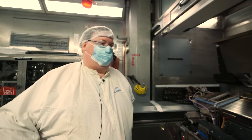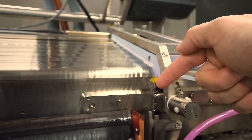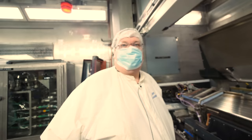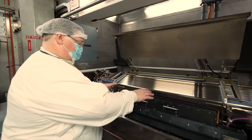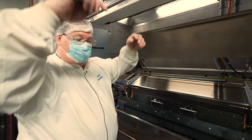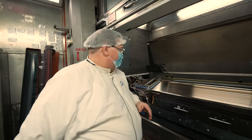We keep laminar flow — that's the secret. What I'm looking at right here is a stream of liquid that looks like one uniform waterfall, but it's actually a series of waterfalls in parallel. Exactly. We do a curtain hopper — what will happen is the roll will be ready underneath. There's a pan in the other room catching everything. It will pop out of position very quickly and then drop about 12 to 14 inches as a curtain. Now, if you pour any liquid out of a jar, it necks down — we can't have that. It's got to stay absolutely laminar all the way down the sides. We have some guide wires that help — those are one of the important steps of our curtain coater.